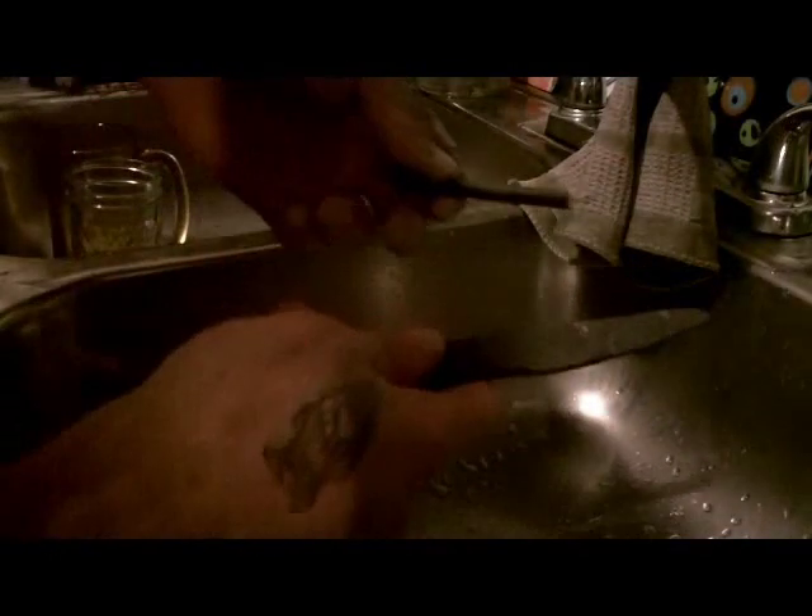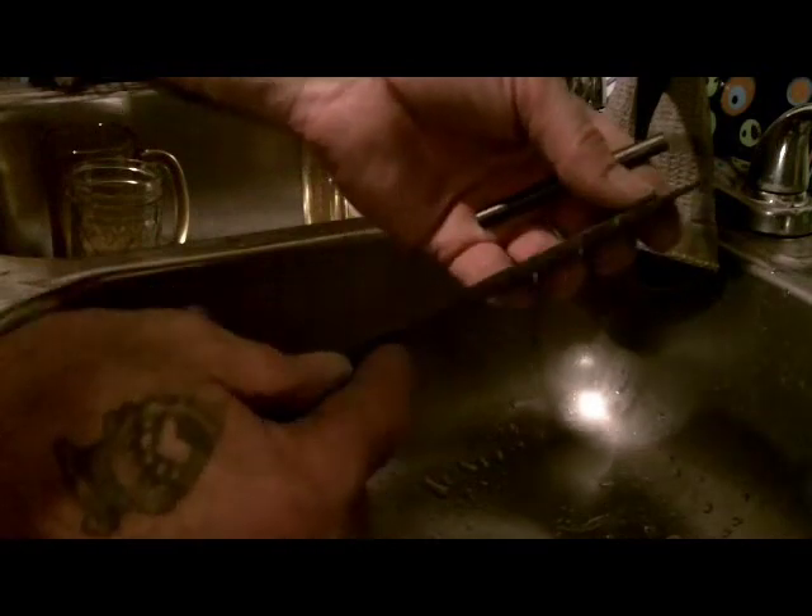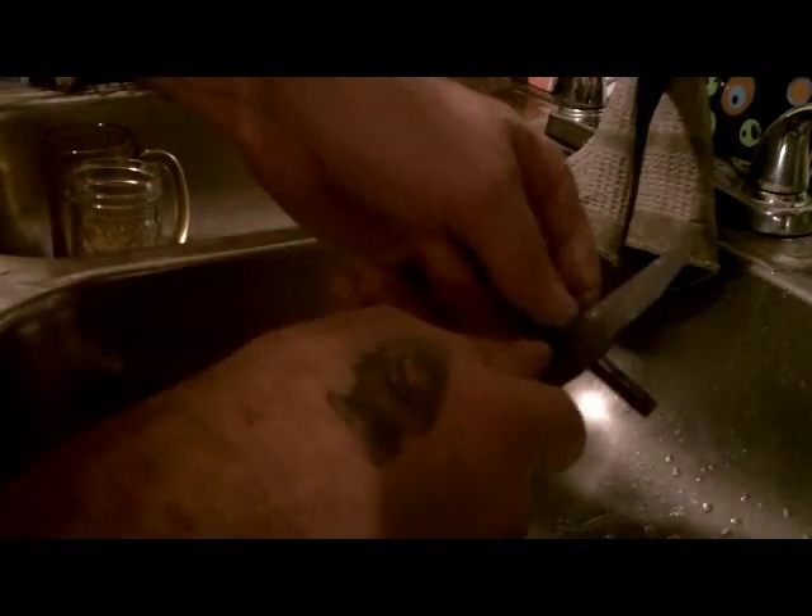Even though the knife doesn't have a good edge on it yet - I haven't filed it, shaped it, tempered it, or hardened it - just trying it on the fire stick and getting good sparks. I wasn't able to do that with any of the other steel I've used so far. It's coil spring - or leaf spring. I think it's 1085 steel, and I think we're going to have a pretty darn nice knife out of that. That coil spring was probably 48 inches long, so if an inch makes each one of these knives, I'm going to be able to make 20 or 30 knives out of that.